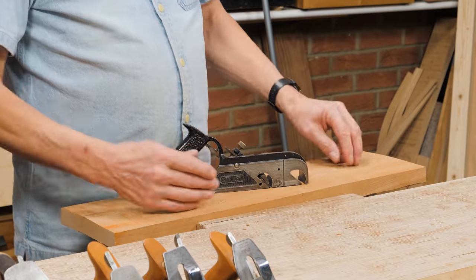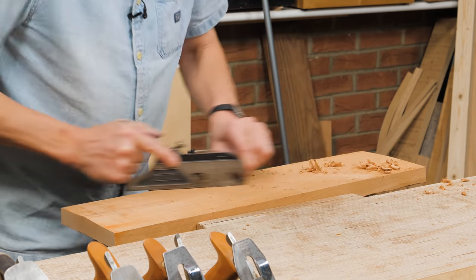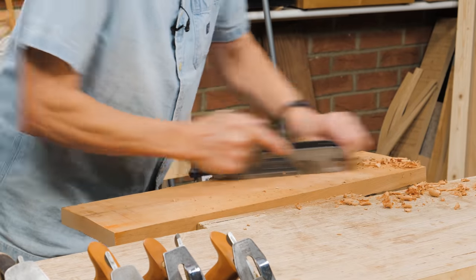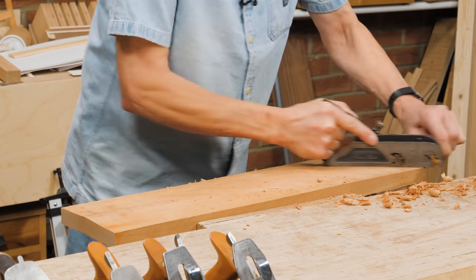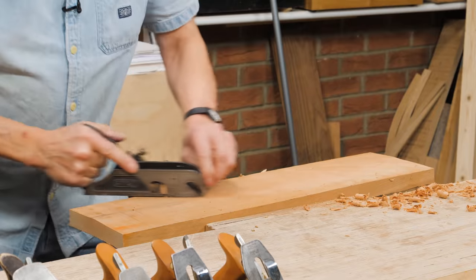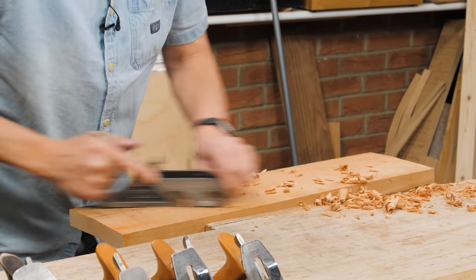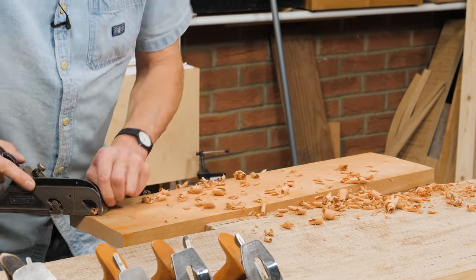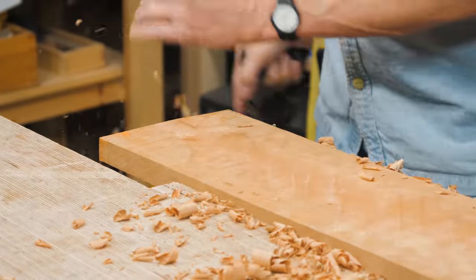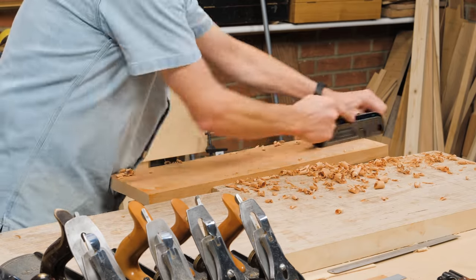I've rounded the iron quite a lot, so when I come to a high spot like this in the middle of the board, I just take the plane and work across the grain — across the high spot from side to side — working that midsection all the way along. That takes the camber down very rapidly. It's a very quick method because we want to get on with our woodworking and not spend a day chewing up a single piece of wood. Once I've got that midsection down, I can go long grain with it, still working on the midsection.